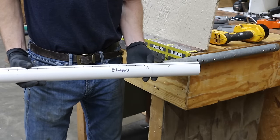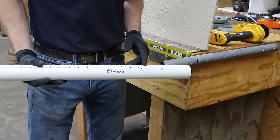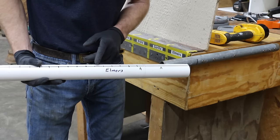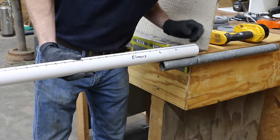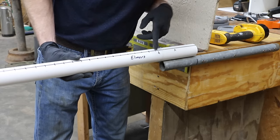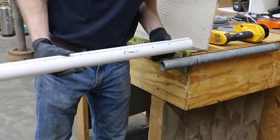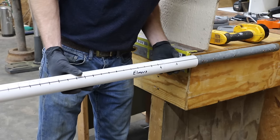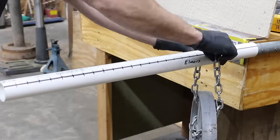In the next test I'm going to measure the ability of these superglues to stick to plastic and measure how much strength they have. I'm going to use a 25-pound plate and begin one inch out from the cut, then continue to move little by little — leaving it in place for only a second or two — all the way out until the pipe breaks. There's a black line on the pipe which indicates the depth at which the pipe should stay; I don't want to go beyond that because then the pipe will be past the cut. I want to be very close to the cut and provide a consistent amount of support for each pipe. We're going to test in order, starting with Elmer's first.